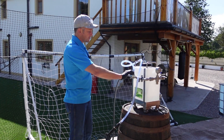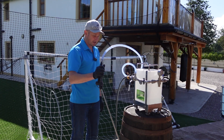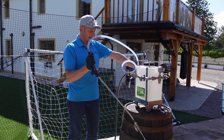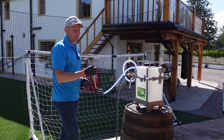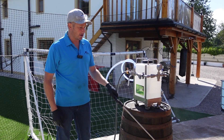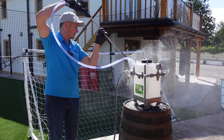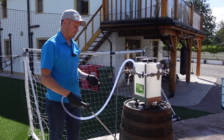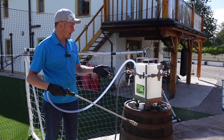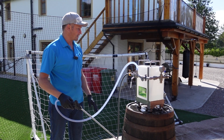However, if you want to turn off your Dosatron for any reason and just want fresh water, turn it down 90 degrees — you now have fresh water coming out of the hose, with nothing coming out of the Dosatron. This fresh water is really useful. I have a shooter tip there for rinsing windows or similar, and we have wide angle fan tips as well. Really useful for wetting plant life, and if you need to you can wash down the equipment, wash down any spillages. You don't want chemical streaks on your customer's property, and it's always going to be fresh water ready when you need it.